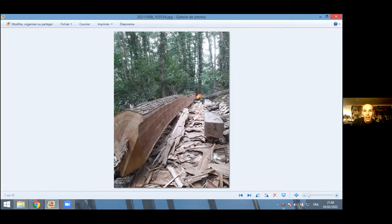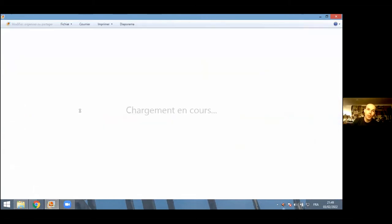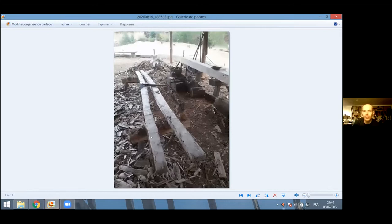One other thing that can be used sometimes: you need smaller lumber for your construction, and you can use the axe to make small wedges and do some splitting. Here is some splitting of oak to make roughly three-inch by two-inch planks that could be used for rafters — here they were used for a wooden crane where smaller lumber was needed. The axe can also be very useful for these planks.